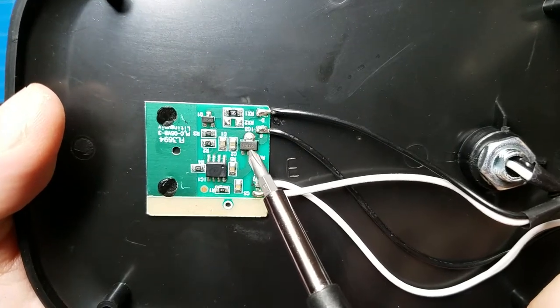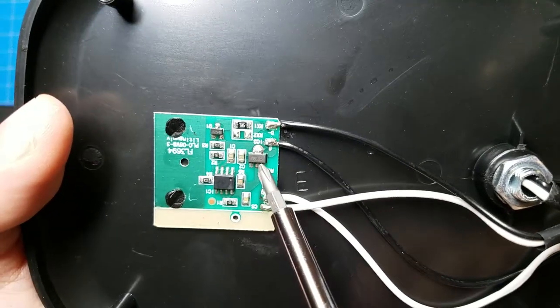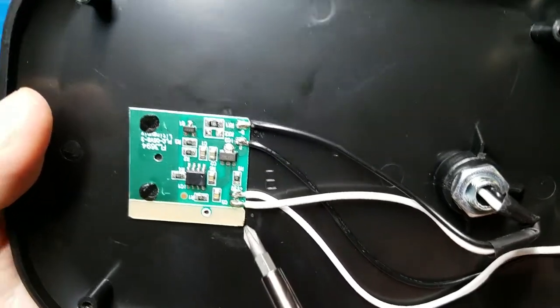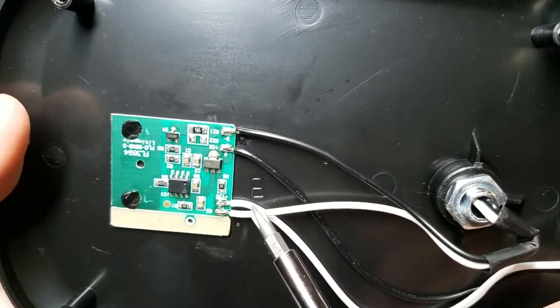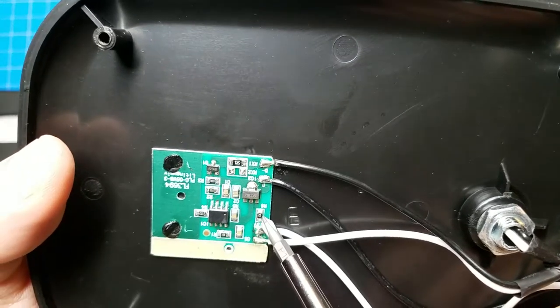Oh, what do we have here? That 78L05, that would be a 5 volt regulator. So it's taking the 13 volts coming in through this resistor. Is that a 0 ohm or is that a 100 ohm? That looks like a 100 ohm resistor, 101,